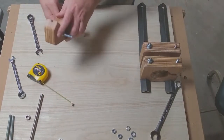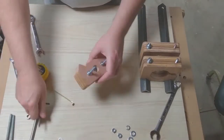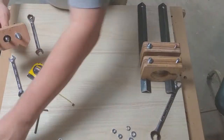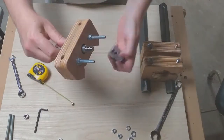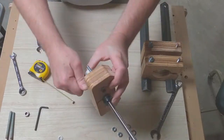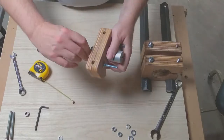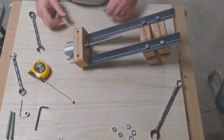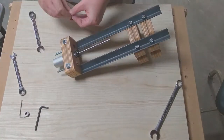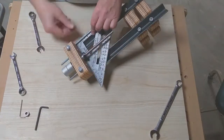Those are furniture bolt nuts. So that's what's holding everything together for the bearing plate. Now that is a threaded compression nut for a 10mm acme threaded rod. A couple spacers and then a compression coupling on the top side securely mounts the jack screw into the bearing plate. Then we tighten the compression nut onto the shaft, which will carry all of the thrust load for the Z-axis motion — the weight of the router as it moves up and down. Using more 5/16" threaded rod and nuts, it gets bolted to the top side of the angle iron rails.